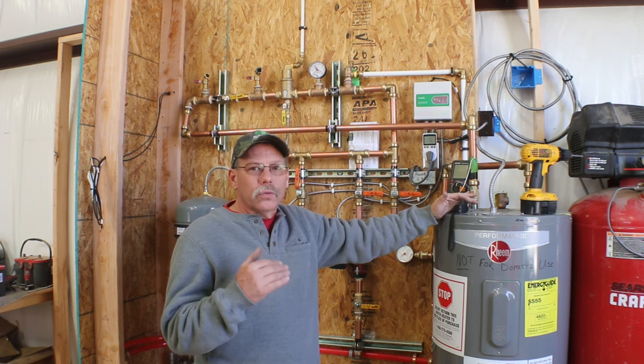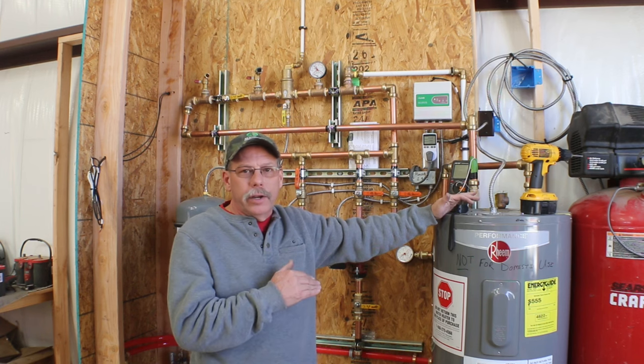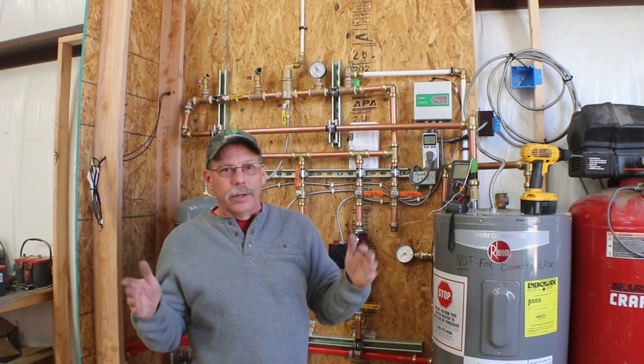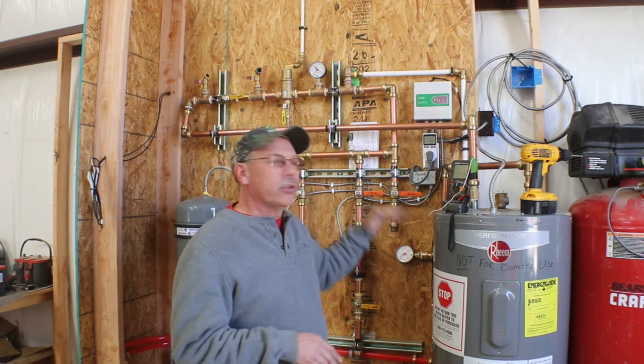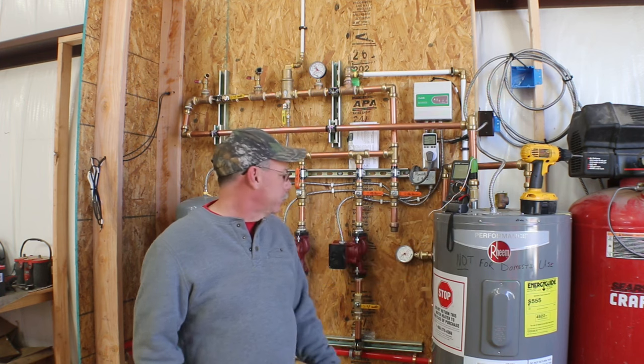And so the pumps are running about 50% of the time with the hot water heater, which is the same goal as I had with 30 and 30 minutes on a timer, but now it's temperature controlled, so I'm not depleting all of the heat out of this tank.